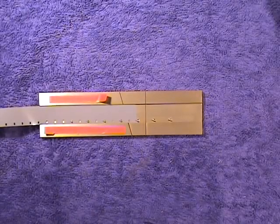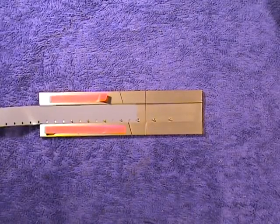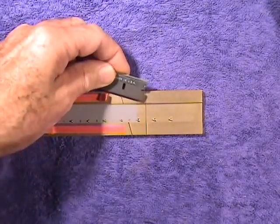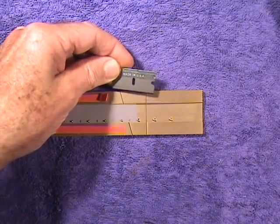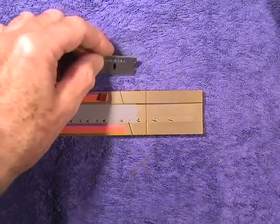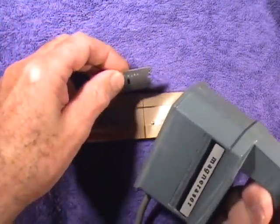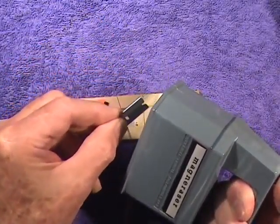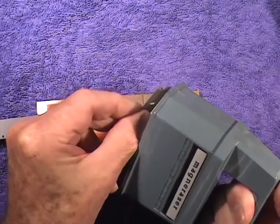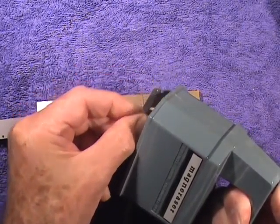If you're going to make a splice on magnetic film material or magnetic tape, you want to make sure that all your equipment is demagnetized. The potential culprit here is the razor blade, because the splicing block is brass. I have a small handheld demagnetizer and I'm going to hold the blade near it until I can feel the magnetic field — that is done demagnetizing it.